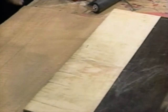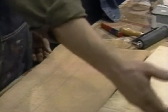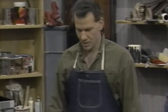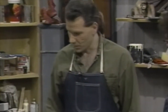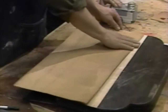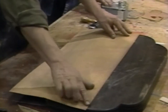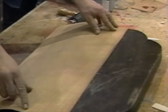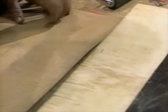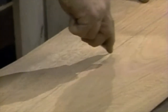We've decided to use a piece of mahogany, because it's got a dark finish on — although I am going to strip this off afterwards — but this will be a suitable replacement. Now we cut it. One edge is square here; this is going to fit in here. We've made a general line for the other cut. This edge will have to be trimmed, and I'm just going to trim off most of this excess with a utility knife.